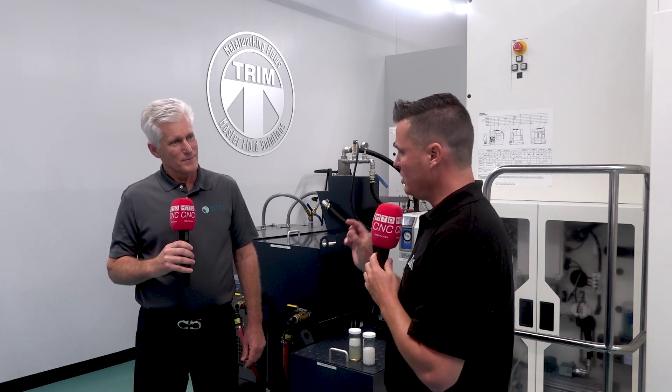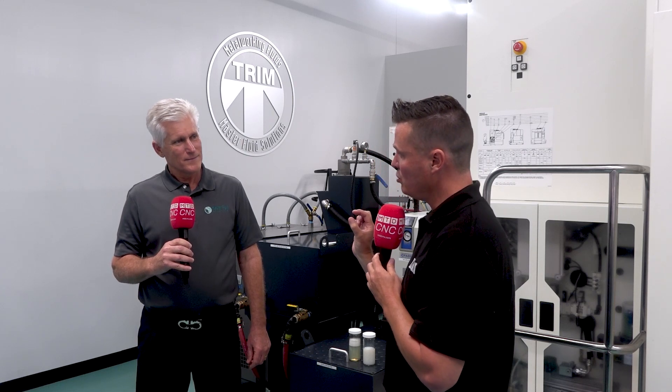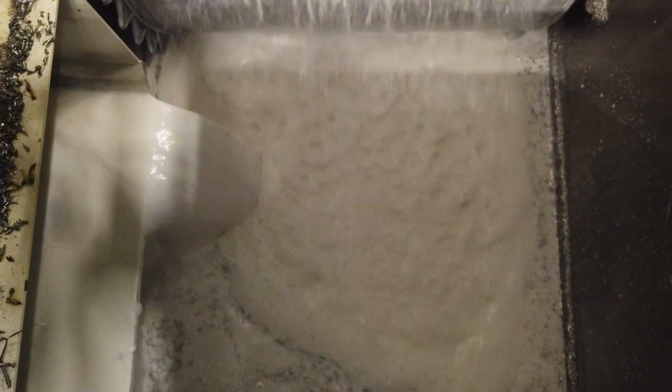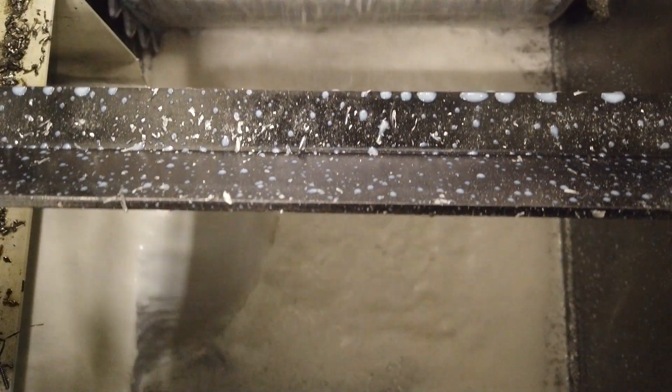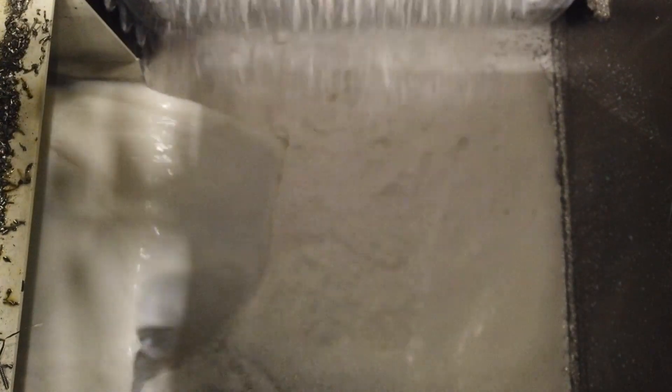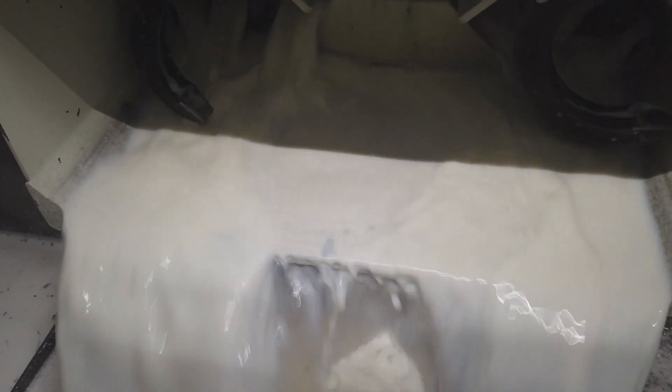The coolant itself, broken down into tiny components — if the filtration units are 10 micron or bigger, the components can get through even on the wide space. If it's oriented in a smooth, circular way it passes through easily, and even turned wide it can still get through. However, when chips start to build up, it instantly reduces the effective micron filtration. Even turned the right way, buildup accumulates and turns into foam, even with the right coolant in there — which is why maintaining filtration is so important.